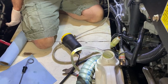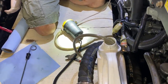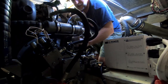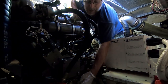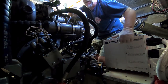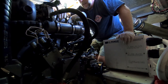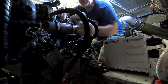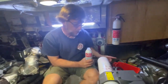We have oil mixed with water — not good. With the little 12-volt pump I've just drained a gallon of oil out of the transmission right here. I did have a problem: the official drain plug is behind where the shaft connects to the transmission, so I can't get to it easily. I'm going to have to do it all through the little pump. I'm going to wait for UPS to bring the new oil cooler and then I'll disconnect everything.